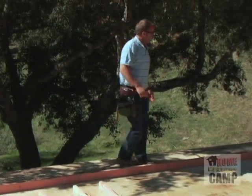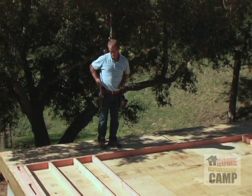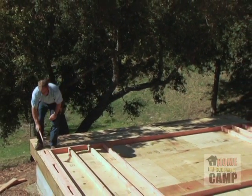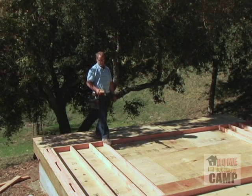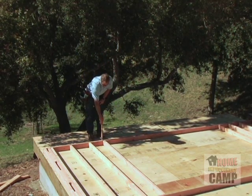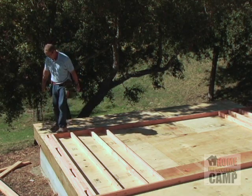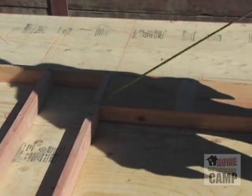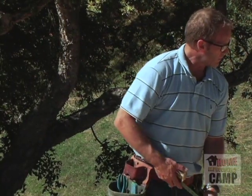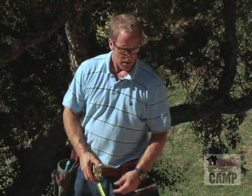The next step is just go ahead, slide up your bottom plate, and nail it off. Make sure you stay on the lines that you've made for yourself. Make sure again that the corner piece is not beyond the end of the plate. Make sure that you look up there and see the king stud coming around, that it's nicely in its place down here. Just bear in mind that this is your little storybook down here, and you want to follow that story very well. So you can see by our story across this plate, we're missing a C, a post, a post, and another C. We remember that a C is a cripple, and the cripple is going to come down from the bottom of the header down to the bottom plate.